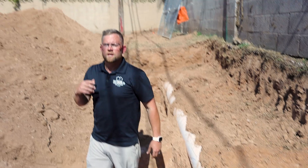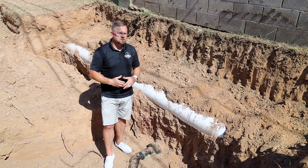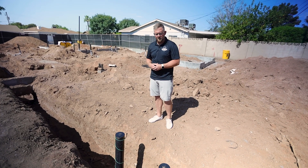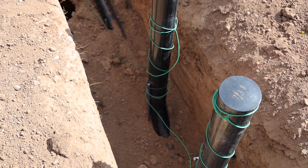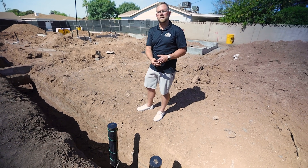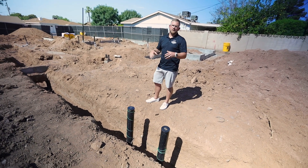I'd like to point out additional features required by city code to ensure our lines can be cleaned properly regardless of any large clogs that might happen in the future. One way we ensure clogs can be addressed is by putting a bullhorn within 50 feet of any plumbing fixtures. This is in addition to clean outs located at each plumbing fixture throughout the home. The bullhorn allows you to sweep appropriately to the rear of the property, and also allows you to address clogs inside the home using the outside clean out leading directly into the main living spaces.